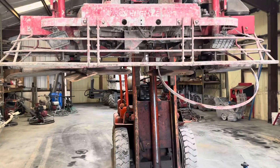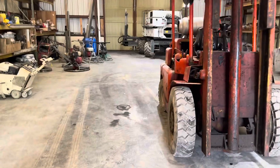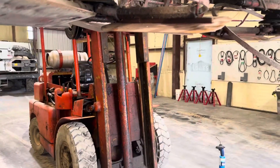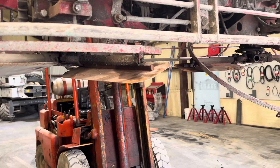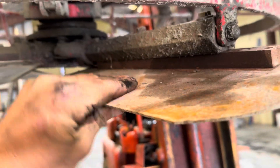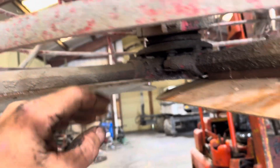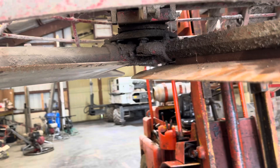So I noticed when I brought it out, it had a wobble to it. It was bouncing and I drove it from the back of the shop up here and it was wobbling pretty good. I was checking the arms — usually if they wobble, that means you have an arm bent, which is holding these blades on this piece here. They usually bend if you drop them or set them down too hard, or from bumps on the interstates. We've had a lot of problems out of those.